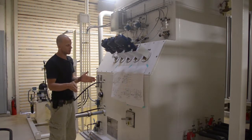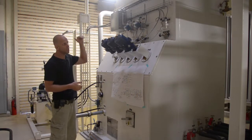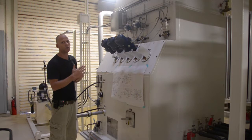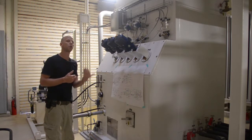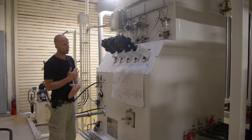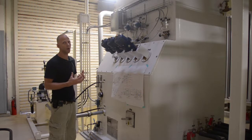Okay. The second split, the second leg of the split, will be process air, which will continue down through the main heat exchanger. Because it's moving in opposition to the cold stream coming up through the heat exchanger from our turbine, that high pressure air, by the time it leaves the main heat exchanger, becomes partially liquefied and is fed into the bottom column or our nitrogen column.